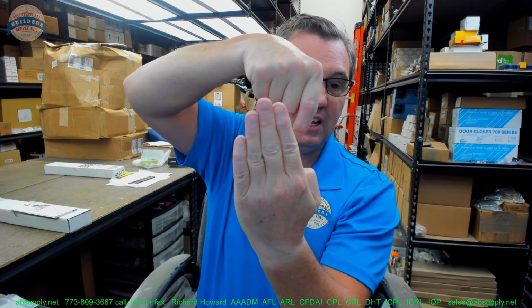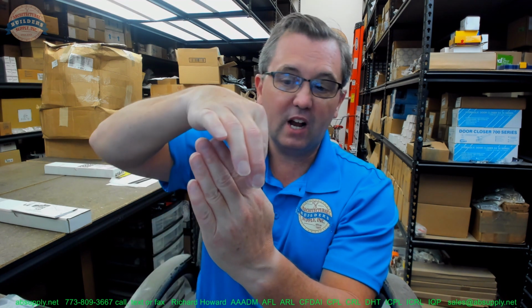You need the body, the deep part, then you need the plate part that sits on top of it. But this forces you to be in proper tolerance of that dimension that you cannot exceed. If you were to exceed that dimension, meaning if your door swung out towards you and your hinges are over here, and you set that hinge back too far in, the door is not going to open because the outside of that door is going to be hitting your trim or your jamb or your wall, whatever it might be. So not exceeding that is the only thing you have to know.